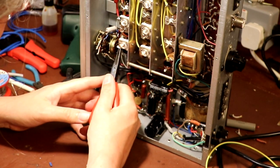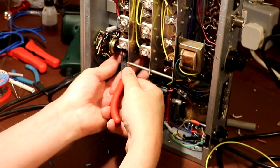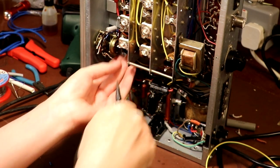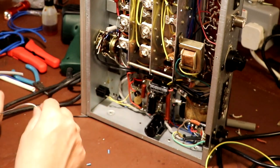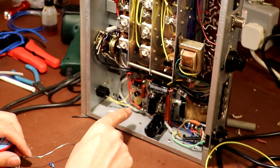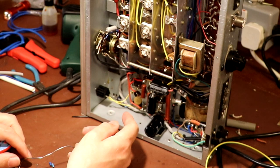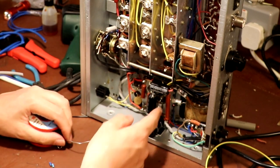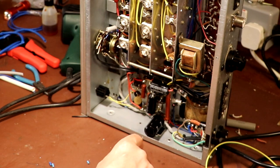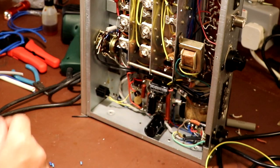I'm not claiming it's super neat, this wiring. In fact, I'm a little bit embarrassed with some of it. Some jobs go really neatly, and I can't really explain it. Some jobs just go really well and you're really pleased with the results, they're dead neat, whereas with other jobs you don't seem to do anything different, but it all just ends up a bit untidy. This is really a bit untidy. I'm not really very happy with the installation of these capacitors. Maybe if I was doing it again, I would try and remove the original capacitor, empty out the insides of it and restuff them. I'm not sure whether these would have gone in or not. They probably would have done, because you do tend to have a bit of a space saving with modern components, but certainly it's not the best way to install these capacitors like this. And everything at this bottom end of the chassis, with it all just being on tag strips, looks a bit messy, or it does to me anyway.